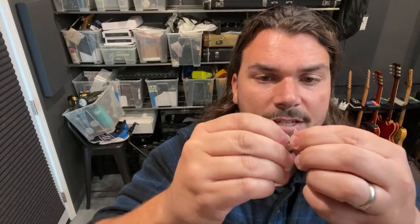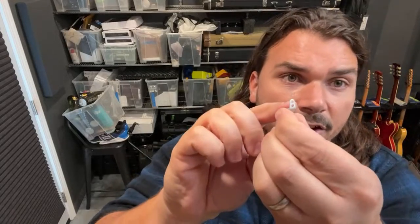Another way you could do it is you could drill a hole and then you could have like a solderable washer. Like, let me see if I have one here. All right, here's one. So here's a solderable washer that you could basically drill a hole into your enclosure for, and you can use a small panel screw like this, and it would feed through the exterior of the enclosure, and then you would tighten this on the inside of the enclosure with some sort of nut. And then you're left with this little hole that you can solder a wire to, and that could be the way that you could ground the inside. But again, the extra step there is that you have to drill a hole into the enclosure, fit that somewhere, and then run a wire to it.